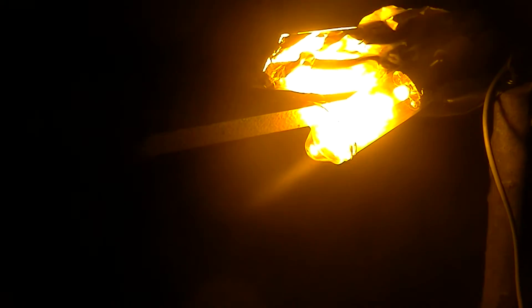Another test of that 18-watt low-pressure sodium lamp and it is fairly bright, which you'd expect. It's only the second lowest power low-pressure sodium lamp commercially made, and the lowest currently made, but 1,800 lumens isn't bad. It really helps having the proper ballast for it.